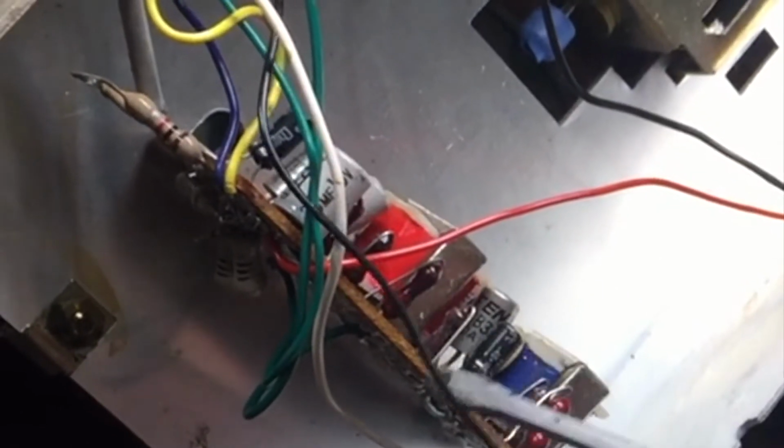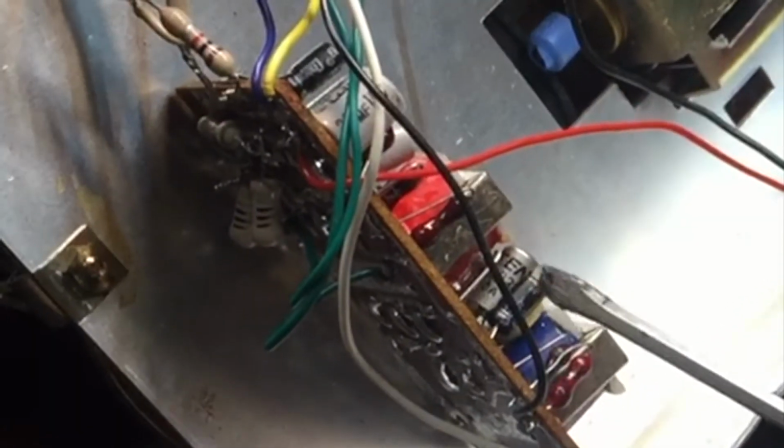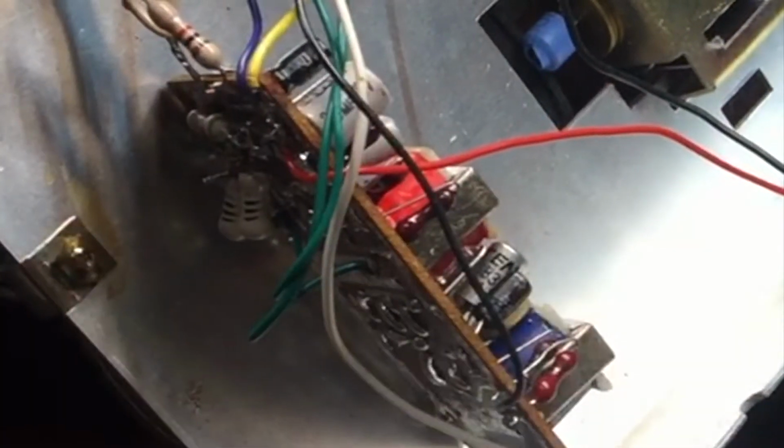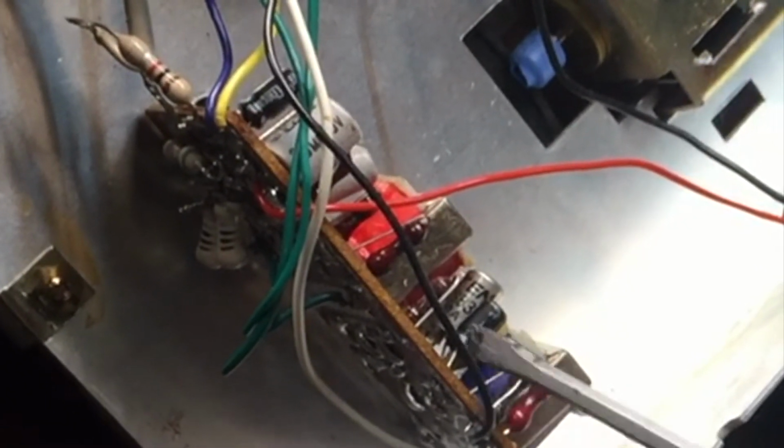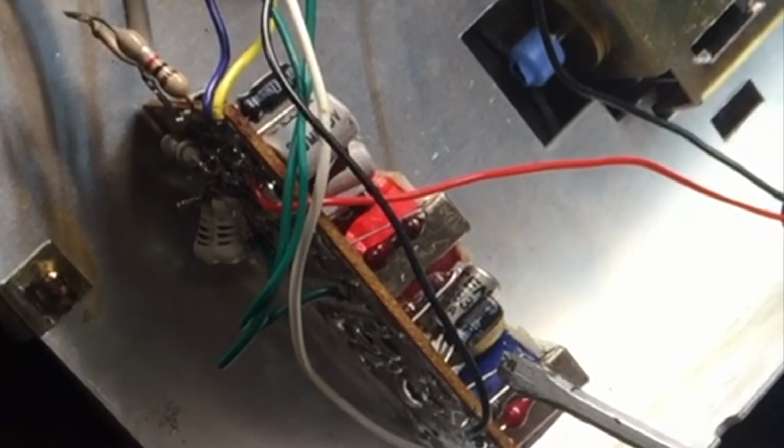There's a cap right here on the record circuit. This is the record line that comes in, and there's the bias resistor. I checked that bias resistor, and it was okay. And so I just replaced this cap in that circuit, and apparently it was bad, because that's all we needed to do. So we replaced this cap here, the input cap, and we replaced this cap here. There's another one in the circuit here, 2 more actually, but I'm not going to mess with them. It's working fine. We're going to leave it at that.